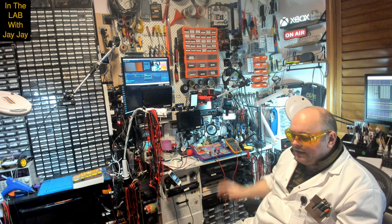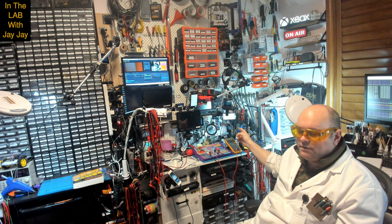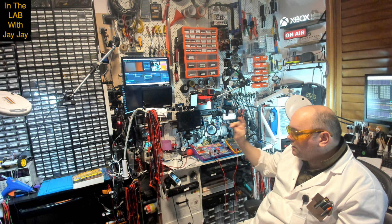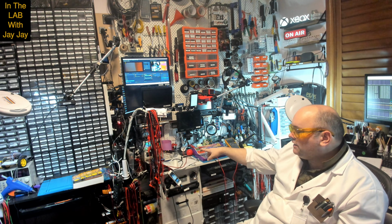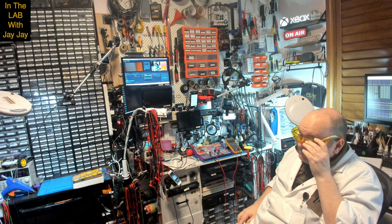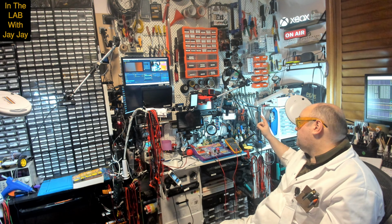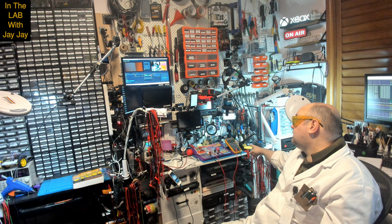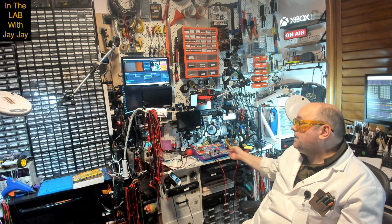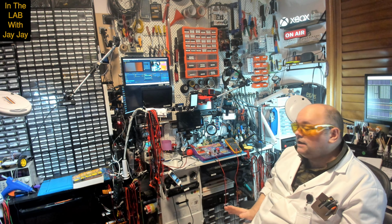So that's really good. As I said, we didn't have any signals, so no oscilloscope today. We did use the thermal cam, so that was good. The bench power supply delivered 9 volts and 13 milliamps. It's actually interesting. The power supply reports 13 milliamps, but the multimeter reports 14.65 milliamps. So I believe the multimeter more than I believe the power supply. But yeah, that was interesting.